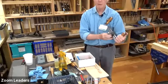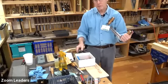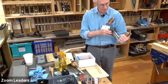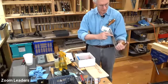So that your fingers stay away from the blade. And it doesn't take much. And you're looking at, this is another place where the Sharpie probably helped. You put Sharpie on the absolute tip there, and you want this to hit the Sharpie and take it off without getting on the bevel over here or farther down, because that doesn't do any good.